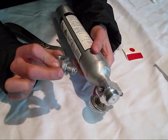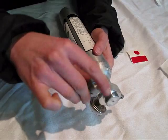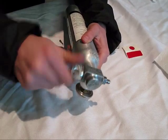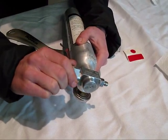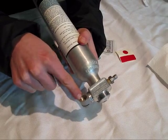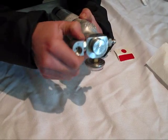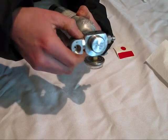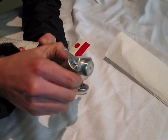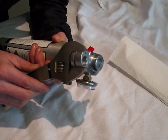The lock nut there is up against that fitting, so I'm going to put that in and begin to twist it in — righty tighty, all the way. This can sometimes be the tricky part: this part needs to be in line with this. So back it off to the right position and then begin tightening the lock nut, working them together. If you end up locking it on an angle, you can use your crescent wrench to gently straighten it out.